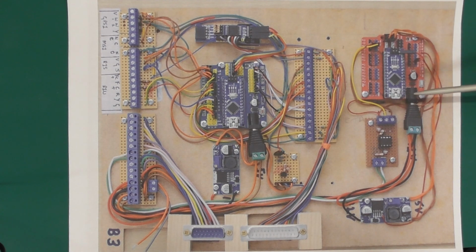And then I enable each servo in turn to the centre, to its correct point, having applied the power when I am ready, when I know that everything is pulled up right. So I don't get any servo twitching. Or if I do, it hardly moves the servo. You hear it rather than see the twitch, which is fine by me. And that's why it's there for two reasons. One, to stop the twitching, and secondly, to provide far more power than the Arduino can provide from its 5-volt supply.